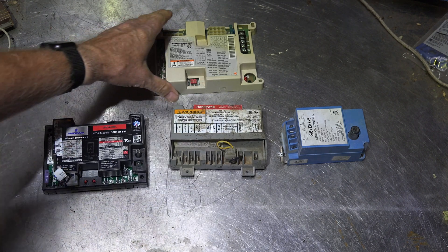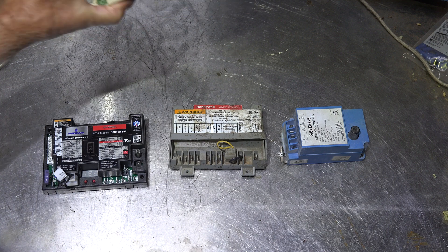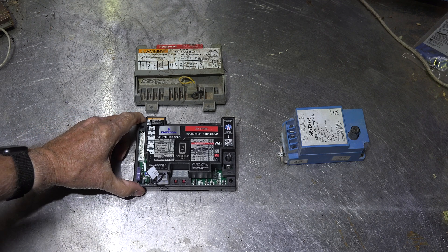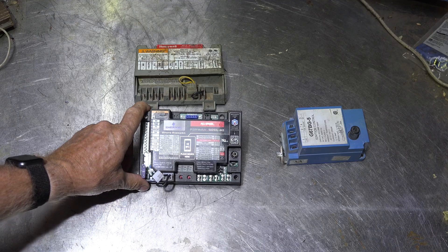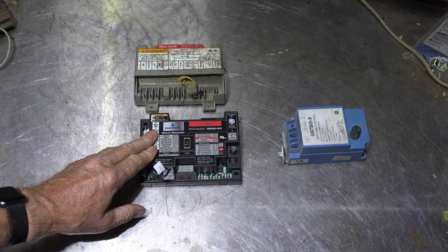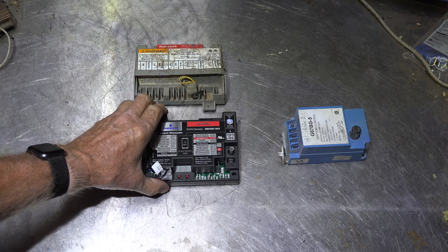That's what this control is made to replace. This control is for furnaces, but these controls here are used for burners of assorted types — they could be furnaces, overhead heaters for shops, or heating devices in restaurants. They all have to have some sort of flame safety control so the flame only operates when it is safe.